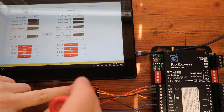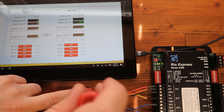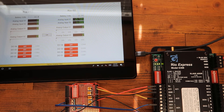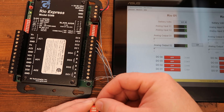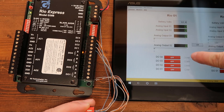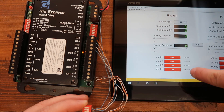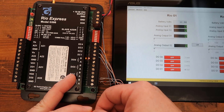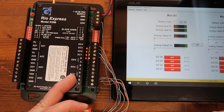I set up a SCADA host system here to demonstrate this. The HMI is Ignition, which is an industrial SCADA host, and the polling engine is ACM, which is doing Modbus RTU over TCP/IP. I'm going to demonstrate the analog inputs — I'll tweak up number two and you should see this value increase, then I'll turn up number one all the way. On this device I'll demonstrate turning on the discrete inputs, so I'll start turning them on — you'll see the check boxes come on here, starting with DI1, then two, three, and four.